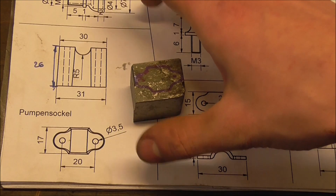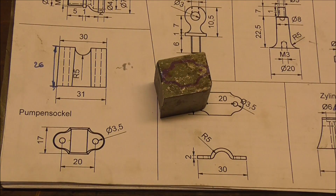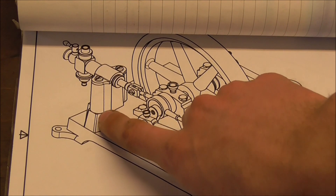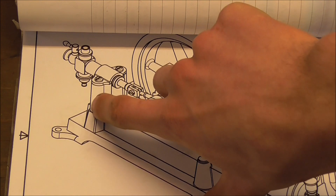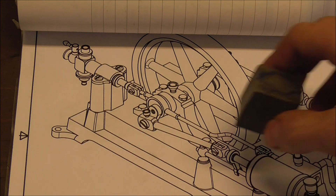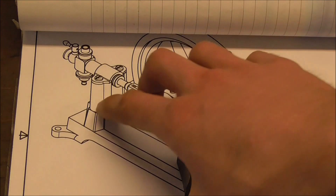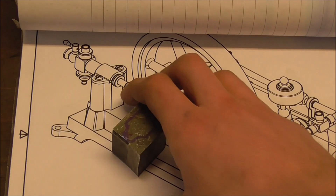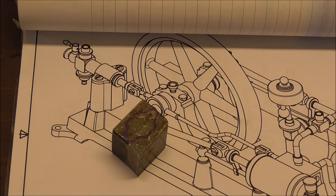You can see that as the whole thing was originally cast, it's slanted on every side, so it's going to taper off to 30mm at the top. When we look at where this thing actually gets mounted, it's way back here, and the only reason I specified 31mm was to have a nice line between the profiles. Making it one millimeter shorter gives a half millimeter gap on each side, which I think is okay — the alternative would be sawing a piece out of some 100mm round slug, and I really don't feel like doing that.